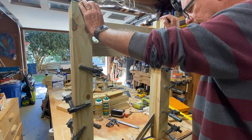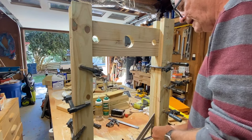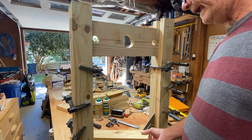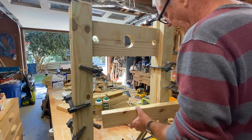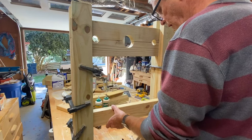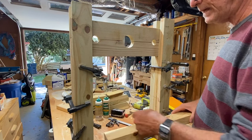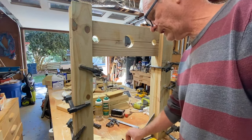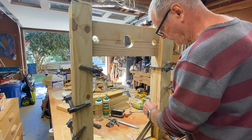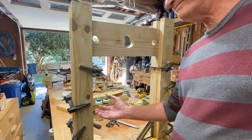I have the stockade temporarily set up on my bench, squared to the table. Between the two columns is almost exactly 18 inches. I want to put a horizontal stabilizing board in between the two columns to keep them from rocking back and forth. I'll use a two-by-four and cut a wedge inside the middle portion of each column. The columns are 18 inches apart, so I'll cut the board to 20 inches so it'll have a one-inch insert in each column. I'll use a one and a half inch forstner bit to drill the hole, then clean it up with a chisel.